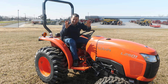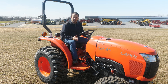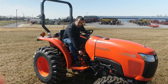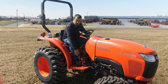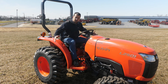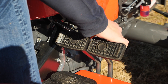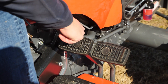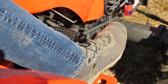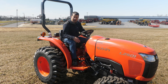Safety alert! What we're going to do here when we start messing with the brake pedal does have some possible safety implications you should be aware of. In their default state, when these two brake pedals are locked together, this little yellow latch right here is closed across the pedal, making both of the pedals work together. If you have an 'oh crap' moment and stomp on the brakes, you're going to lock the tractor's rear end, both tires together. However, when you enable these steering brakes and flip that latch open, if you have that moment, you could stomp on this brake pedal — if you only hit one of the pedals, not both, you're only going to brake one wheel, potentially making that moment even worse. The latch is yellow for a reason because there are safety and movement implications for how your tractor functions.